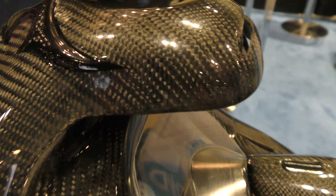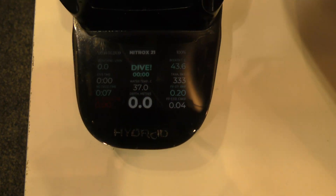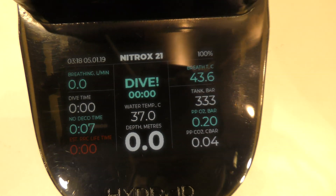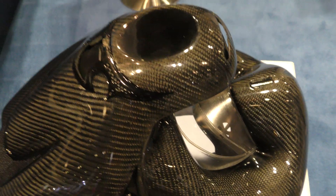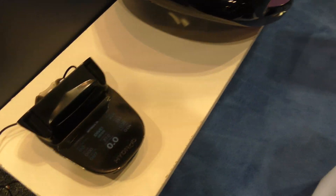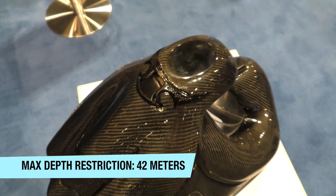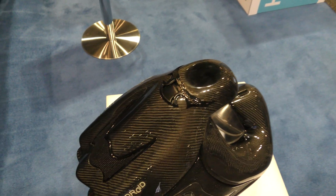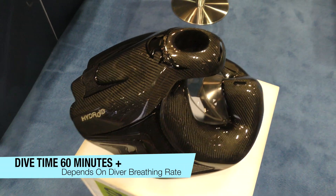As they mentioned, there's a heads-up display that basically gives you all of your dive concentrations for your various gases — right here is a look at that. So that's what the diver can actually see from within the helmet. Also on top of this unit there will be a light: it glows blue if everything's okay, red if things are not looking okay, and violet when the diver's in decompression.